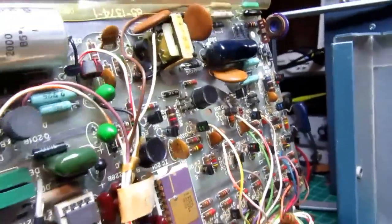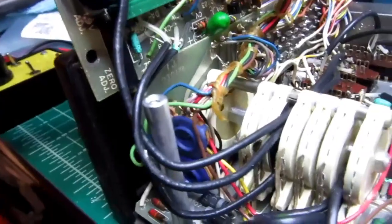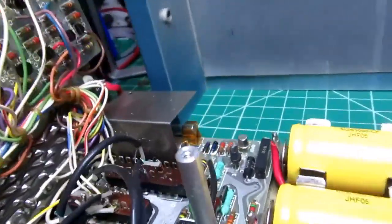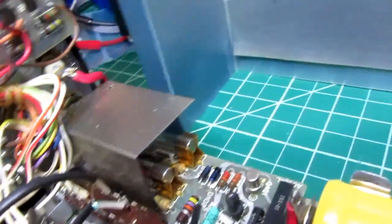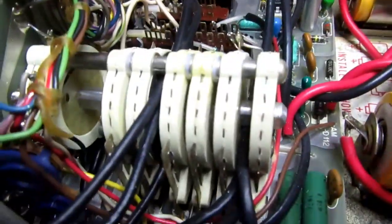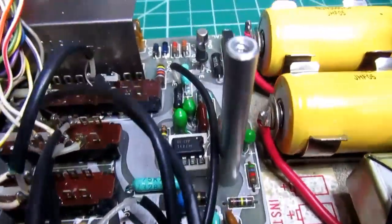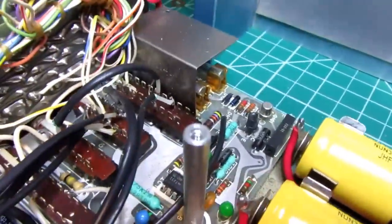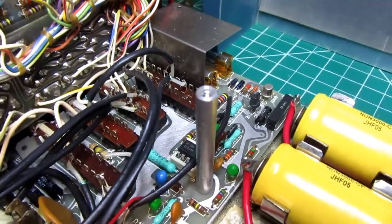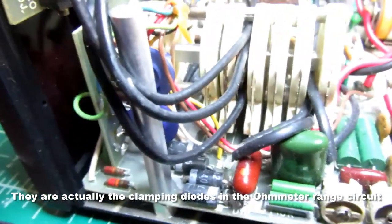Anyway, I lied before. This is not a single-sided board, it's a double-sided board. And it's all connected up with a wiring harness to the rest of the meter, and a few shielded cables as well, which run back and forth. And now the lower board has a fusing section down there under a shield, and there's also all the switching for the front panel push button switches and the selector switch, and then all of the resistors for the range selection. And over in the corner of the board with the IC down there, that's an op-amp. That is the circuit for the AC precision rectifier, or the AC to DC converter. And that's why its trim pot is down there in the center of the picture. There's also the large diodes down here, which I think are for the power supply, but I haven't actually checked to see what those are yet.